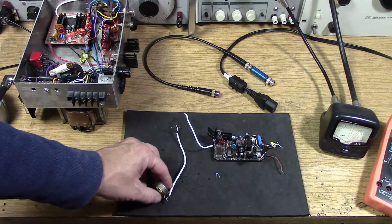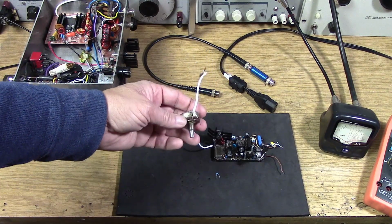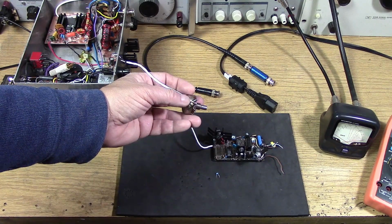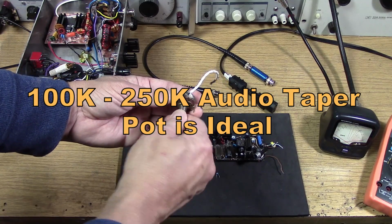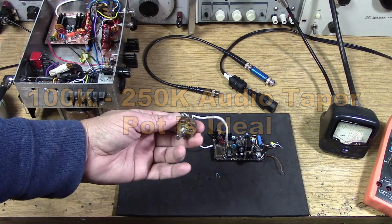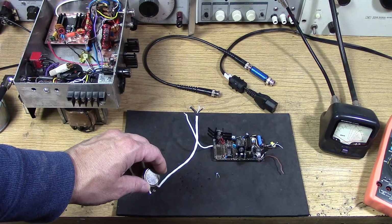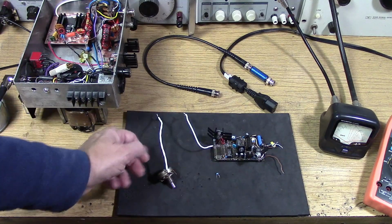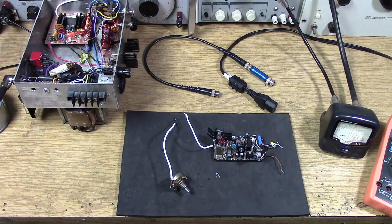While I'm at it, I'm going to put in a potentiometer to replace that fixed 100K, so I have a microphone gain adjustment. You can see how I've carefully attached a shielded cable that has 2 wires inside. I have it set up so that it goes to higher resistance as you go clockwise, as a volume control should in a feedback circuit with an op-amp. And I've carefully prepared the ends so it won't short on the bottom. So I'll be able to adjust the gain very easily compared to having to take the board out. I will solder this into the bottom of the board to take the place of the 100K resistor. So, some improvements. If I have to remove this thing, I might as well do an upgrade while I'm at it.